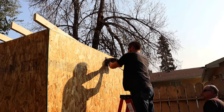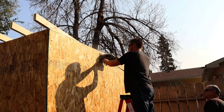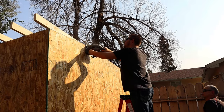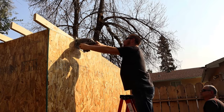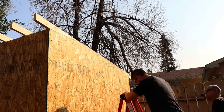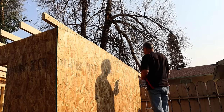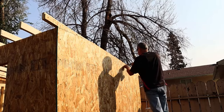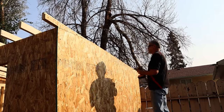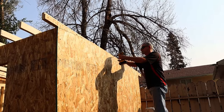We still have one small problem — the front and back sides of the trusses don't have any sheeting material on them. But it's a simple fix: the pieces we just cut off already have the correct angles. It's literally as simple as holding them in place, cutting them to length, and attaching them with a couple of short screws. Once you've got the front and back sheeting material on the trusses they're all capped off, and you can finish attaching the wall sheeting to the trusses all the way up.